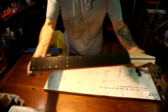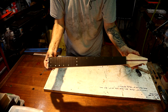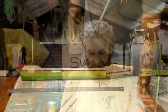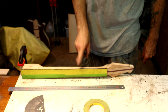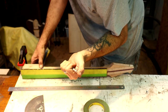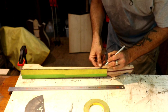There we go — the Saris neck. I'm super happy with the fret marker design. Our fretboard is sanded dead flat with a 16-inch radius. It's time to start marking this thing up for a carve. Tonight's Thursday, August 3rd, so I'm about to have a three-day weekend — we're absolutely going to get this neck carved. I want to make myself a mark two millimeters below my fretboard using a 0.5 millimeter pencil, and I need two points of reference so I can draw a straight line.